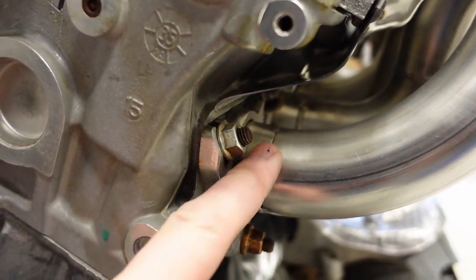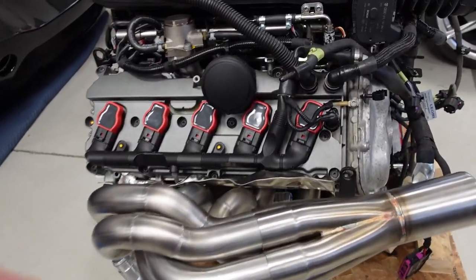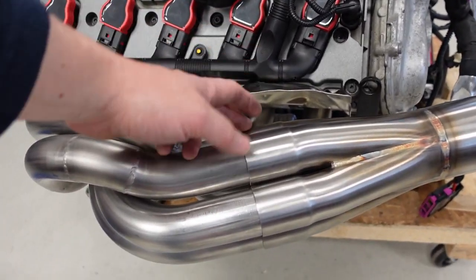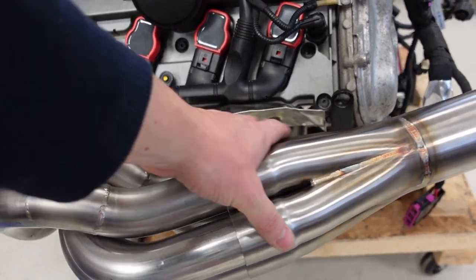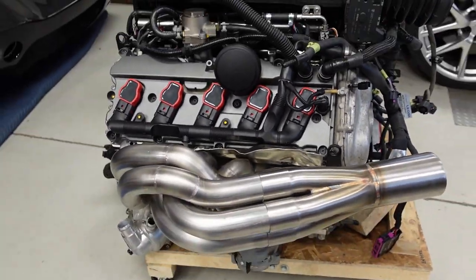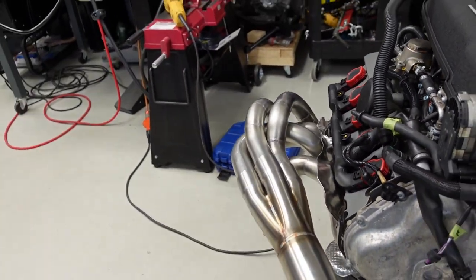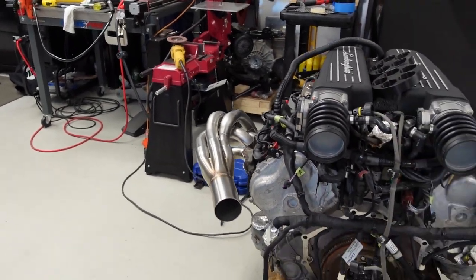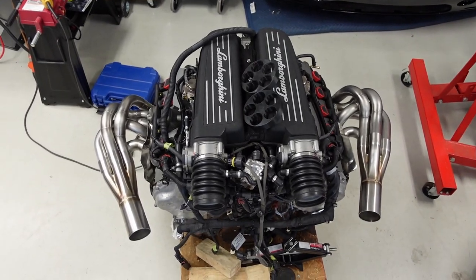So I've got to weld all these tubes up and I'll do that right now. And then all I've got to do is weld on a couple of mounting tabs just to make sure that with the heating and cooling these don't work their way off. Just slide them in there. But they're a super snug fit. That pipe expander, tube expander, worked perfectly. So I am absolutely stoked at how these came out.